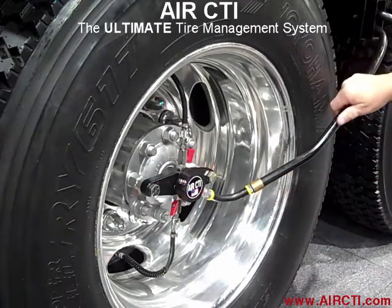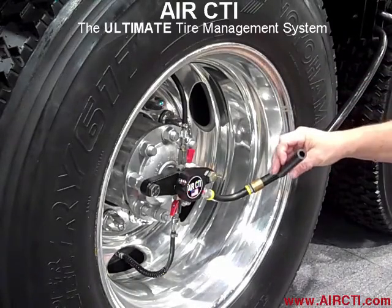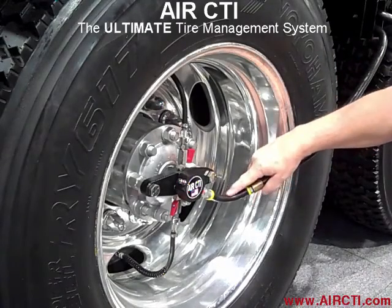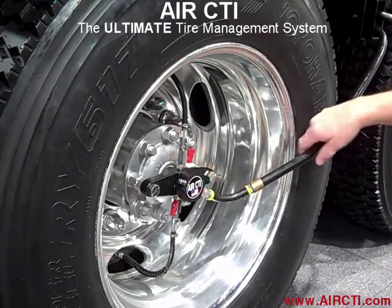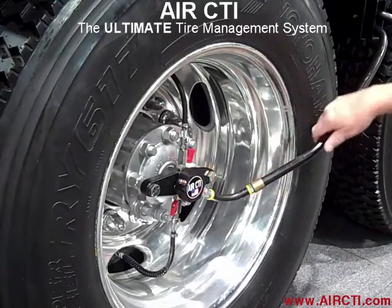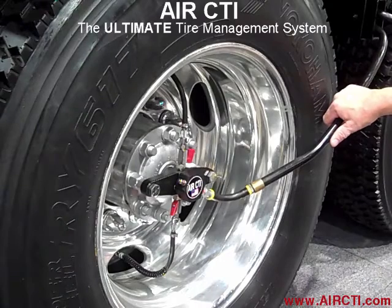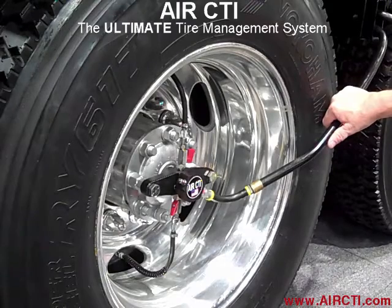This pipe is a very sturdy pipe — as you can see it has a very thick wall center, so it's very durable and not easy to destroy. We have this built in with a flexible push-on airlock hose we call a fusible link. But if anything were to snag this and make it rotate up, it will actually break this hose off before it rips the tube, so the only thing you have to replace is this small hose. It's a push-lock hose — you keep a spare in your truck, cut a length to fit, push it back on, air the tires back up, and you're ready to go.